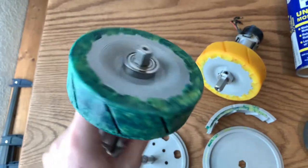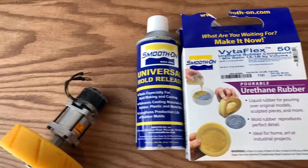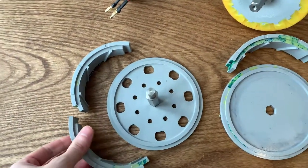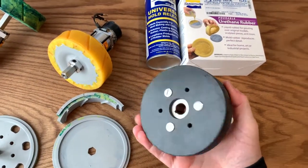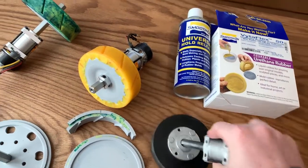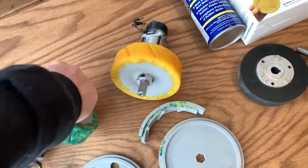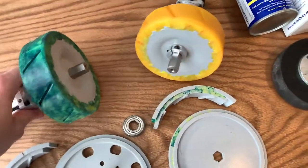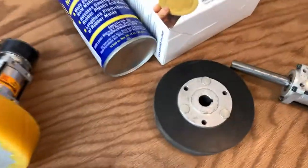The wheel is finished. This is the second wheel we did with the crazy colors and it turned out really nice. We used the official Smooth-On mold release spray, which allowed the wheel to come out without destroying the mold, saving lots of plastic and print time. Just so you know, this is what the old wheel looked like — solid waterjet-cut polyurethane, very heavy. You can see the original shaft went in here with a keyway. But if you want to save weight, you want to leverage the hex shaft, hex bearings, and a hex shaft collar — that allows you to run the custom wheel without any additional fancy hardware.